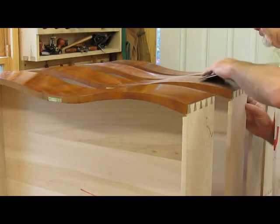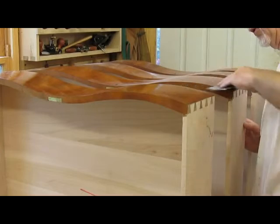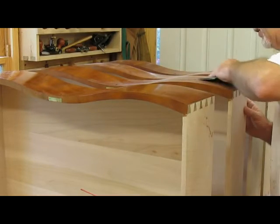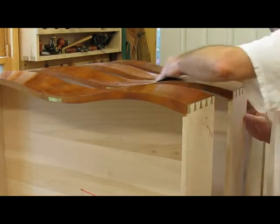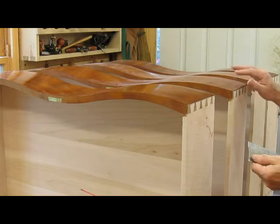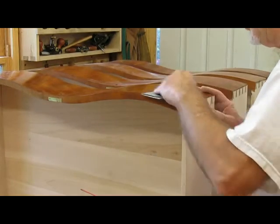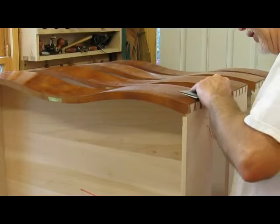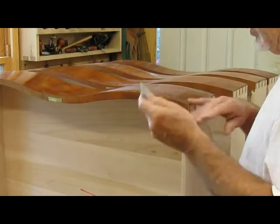You have to be careful not to take the stain off the edges, but it gets nice and flat and smooth between the coats. You don't have to sand between coats, but you end up with a better finish at the end if you do, because the dust nubs build up over six coats and get harder to rub out at the end. It doesn't take maybe ten minutes to just lightly go over the finish.